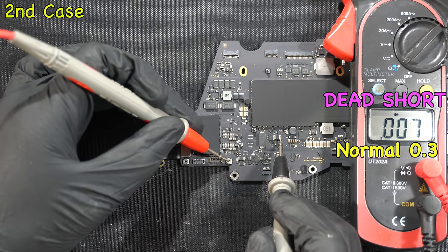To sum up: five of the MacBooks just wouldn't turn on because of a dead capacitor; one MacBook suffered a dead M1 CPU due to water damage — the user's fault; and one Mac Mini suffered a dead M1 CPU for no apparent reason. Six of the seven dead logic board cases were caused by manufacturing defects — not the user's fault at all. However, it's not the end of the world as long as you send it to the right repair shop. Thanks to the InfiRay P2 Pro thermal camera, we were able to locate these dead-short components almost instantly and precisely. If you're interested in getting one, apply the discount code linked in the description.